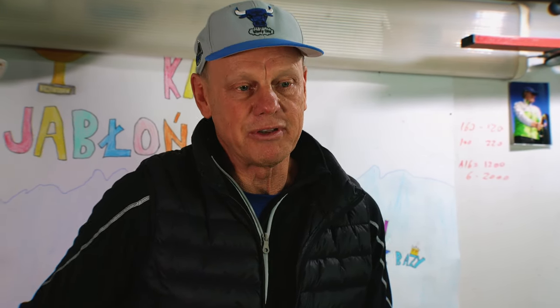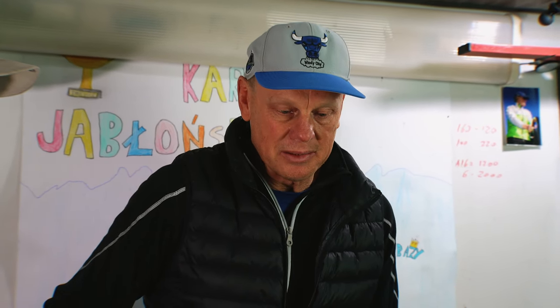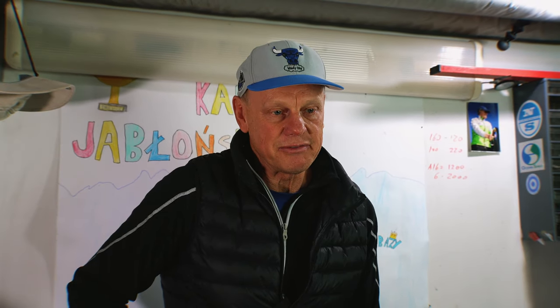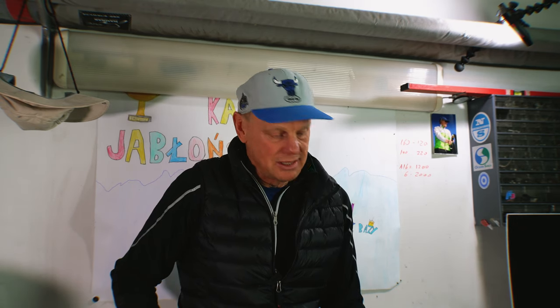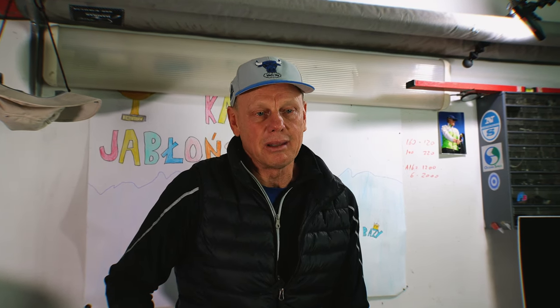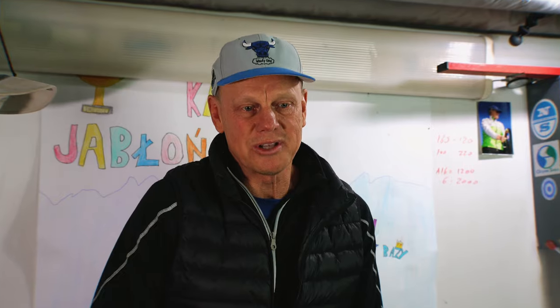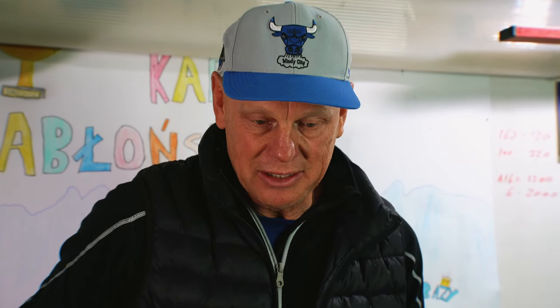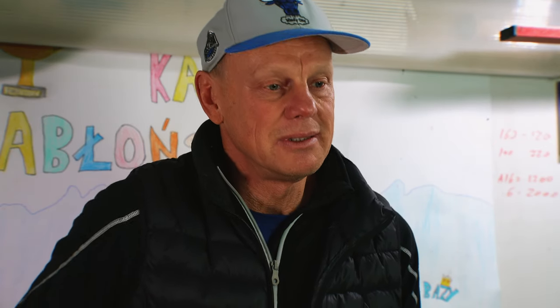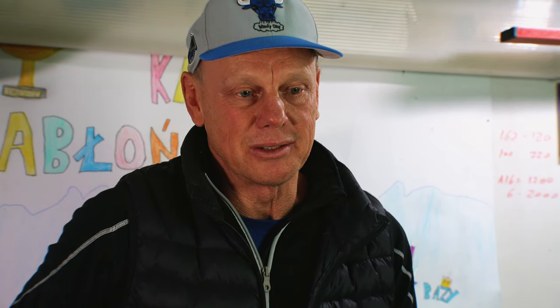So myself, I have one rule: if I am getting closer to the crown and I finish my runners with, for example, a belt 80 or 120, I just leave the runner outside during the night, and I look at the temperature, like -5 or -10 degrees, and I check the runners the next day or 2 days later, once they have really cooled down. And then I am sure that this is about the temperature and the straightness of the stainless steel, the stainless steel is cool enough, and the crown is the real crown.